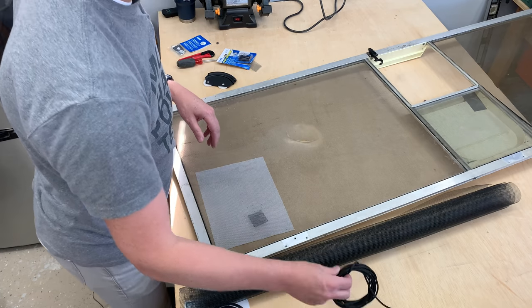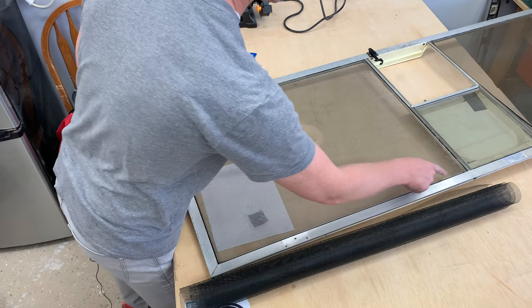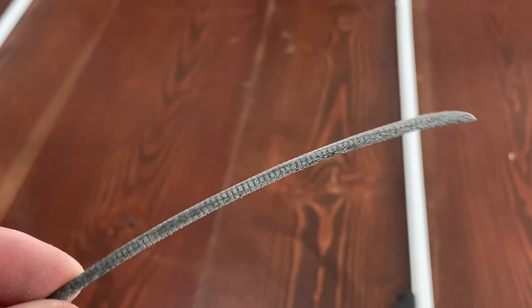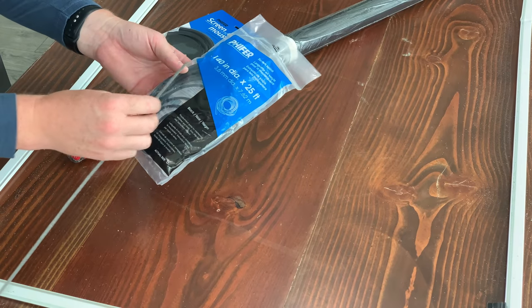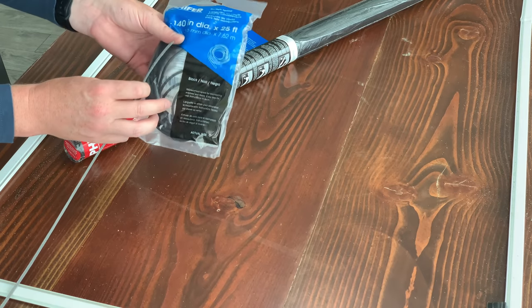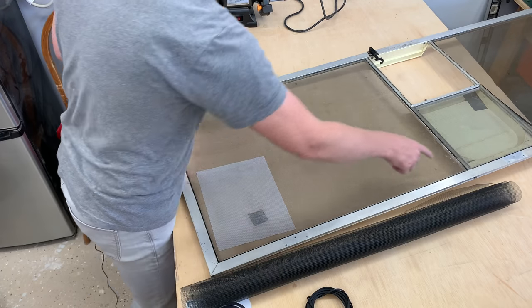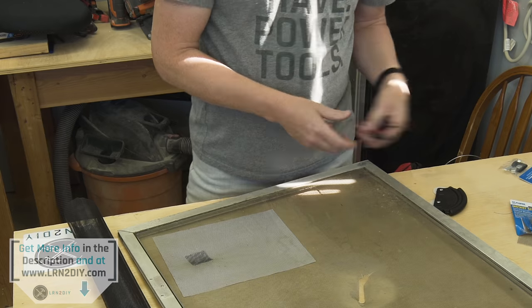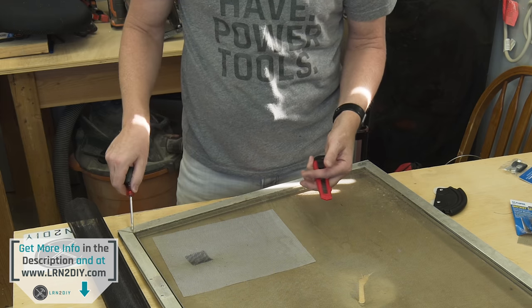A couple of other items you'll most likely need is the spline itself. You can see in here this little piece — it's a little rubber hose-looking thing called a spline. It's typically black and comes in multiple diameters. There's a 0.14 or 9/64 of an inch, and that's the most common size. Before you go to the hardware store, make sure to take a look at what size you've got, and if possible bring some with you so you can make a perfect comparison. You don't always need to buy new splines — sometimes you can reuse what's in there. You're also going to need a spline roller (about $5 to $6), a straight edge blade, and maybe a flat head screwdriver to help with the corners.